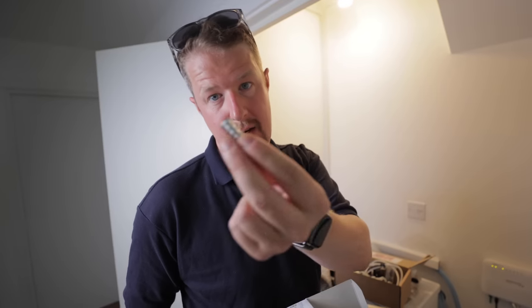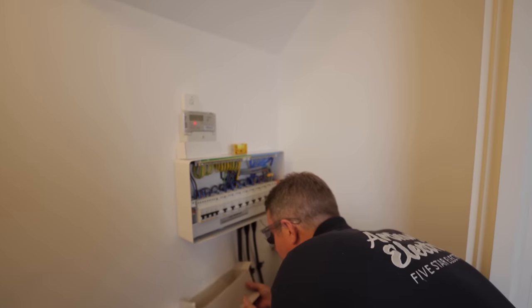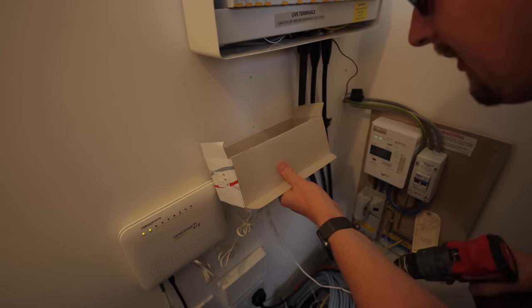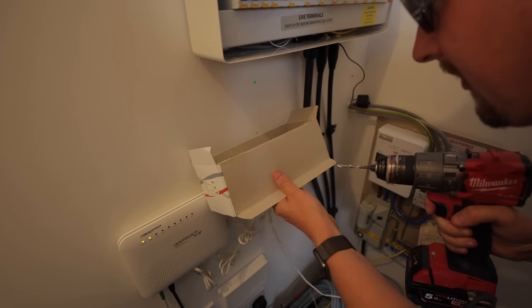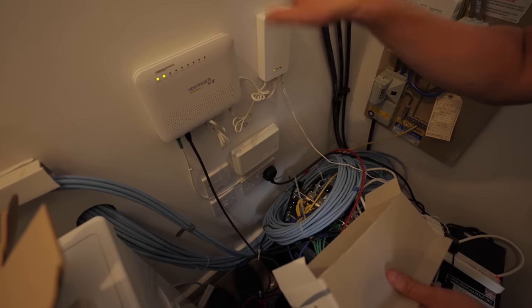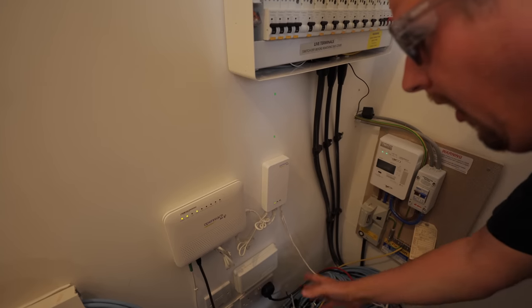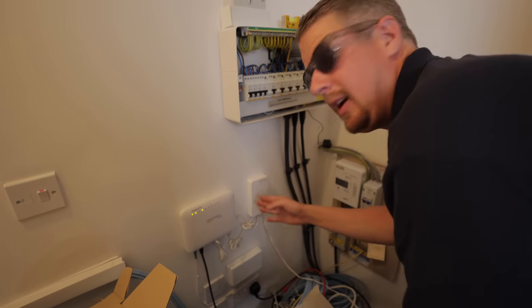This is what we call a drywall or plasterboard wall, so there's no studs or wood to fix to, so we're going to use these plasterboard fixings which are really nice and solid. I like to use this little marksman tool just to mark my holes. Now I get to use my safety glasses — check the link in the description where you can get some really cool stylish safety glasses with a discount using our special code. I'm going to pop this underneath here to catch the dust — really useful rather than having to hoover up afterwards. Also be careful there's nothing — no cables in the wall — and note that there's a double socket below, so as a rule don't drill directly above a socket or switch because there might well be a cable there.